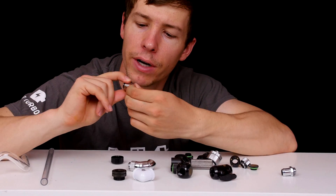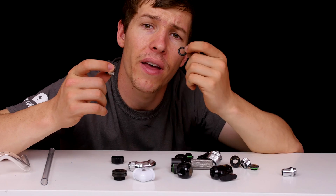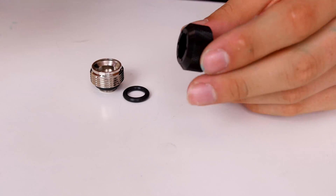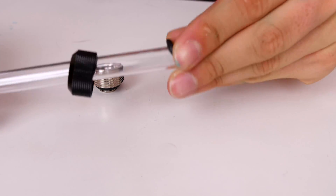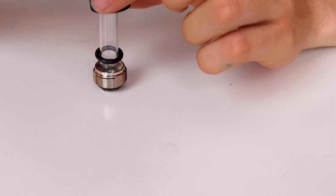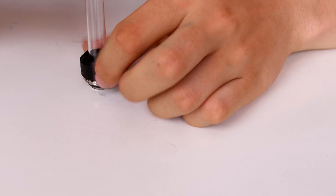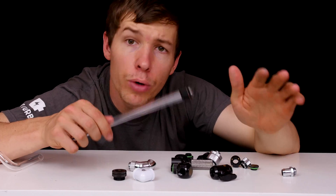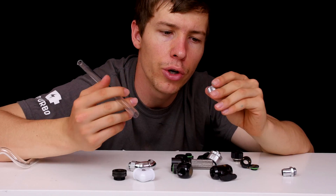All of these compression fittings come with O-rings inside — I just pulled one out here. These O-rings are important; they keep all the water inside. To install your tube, first put the compression ring through the tube, then get your O-ring and install that around the tube — you don't need to push it all the way down. Then put the compression fitting over the tube; the O-ring should sit at the top. Push down and tighten up, which compresses the O-ring against the tube and fitting, creating a nice tight seal.